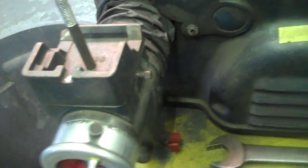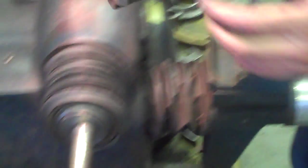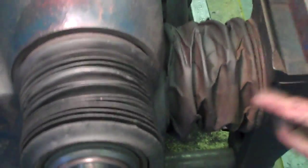There's a little nut right here. Come over to this side — this little nut we need to loosen up. So I'm going to loosen this nut; that nut is what keeps this from pivoting. Before I mount my bit, I want to check my edge. Look at that — this is loose. That's the typical mistake most people make: they just mount it and don't check the bit or the edge on the bottom side. It needs to be nice and crisp right here and right here, which it is. Nice, good edge — I just need to snug it down. If I were to machine this right now, that would have created a bad machining.